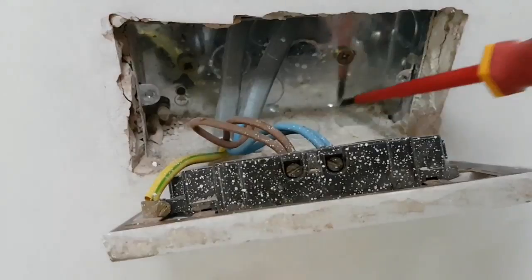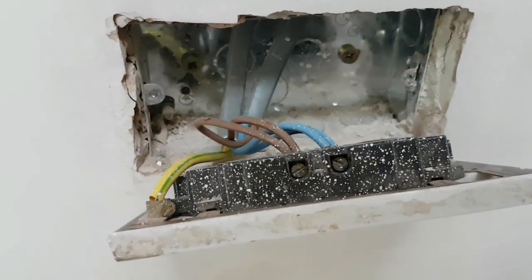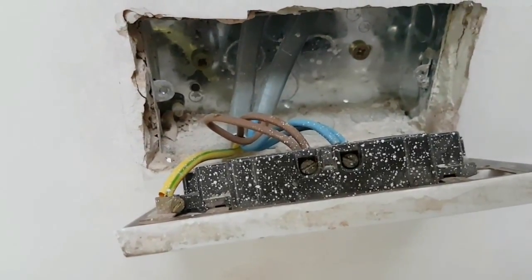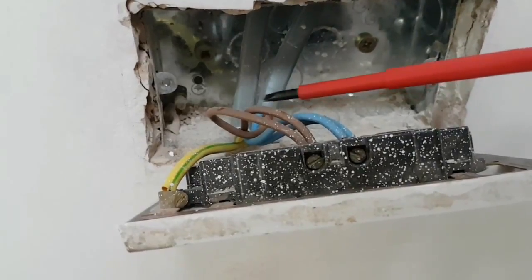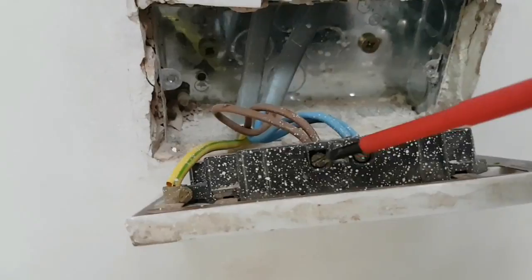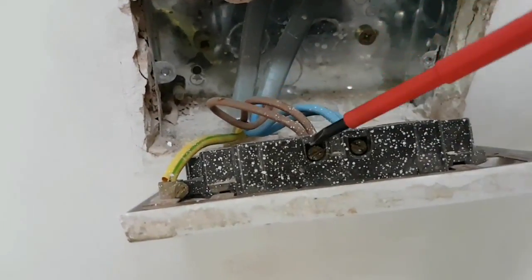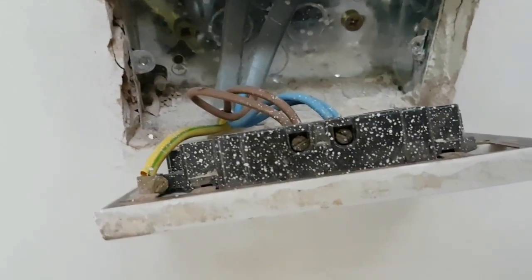You can now take this device out. You can see the metal back box — the good thing about this one is it's actually a 35mm back box, which is good for your flat chrome plates double sockets. You've got your wire coming into the socket and one going out, so it's a ring. You've got your brown which is your live and your blue which is neutral, and two earth wires — so I'll simply unscrew all three and then place the new socket.